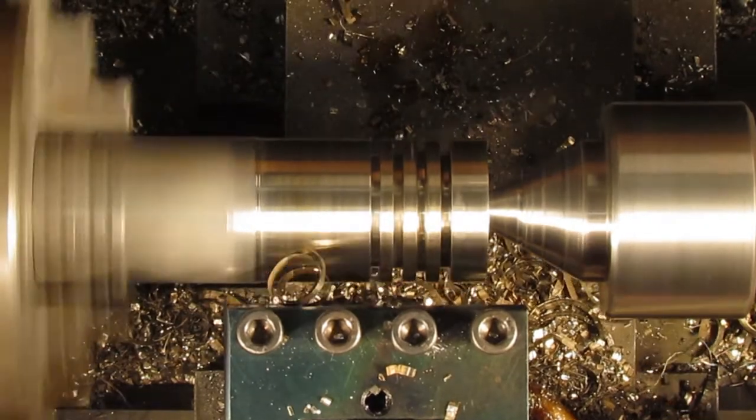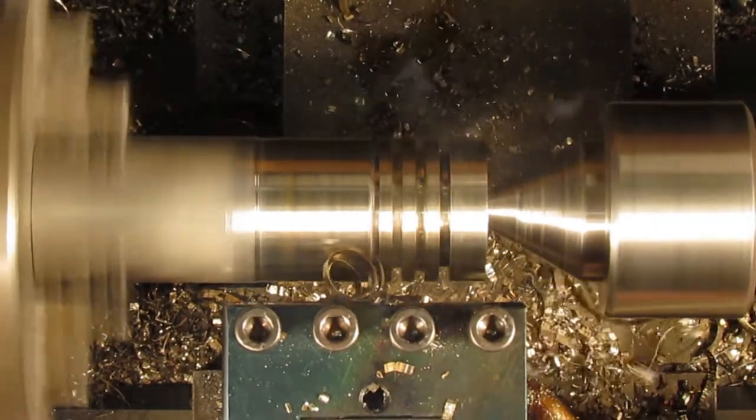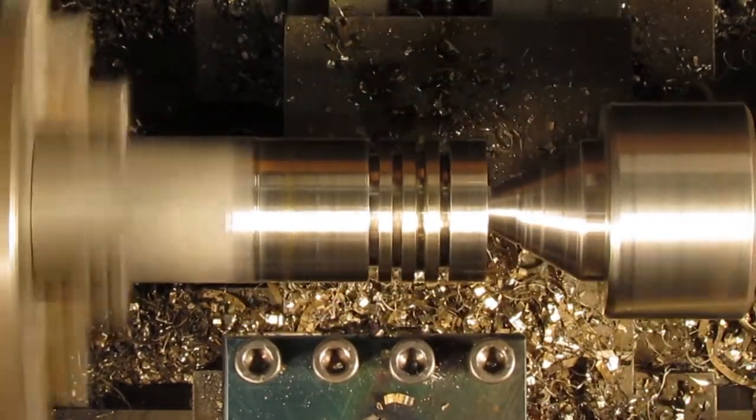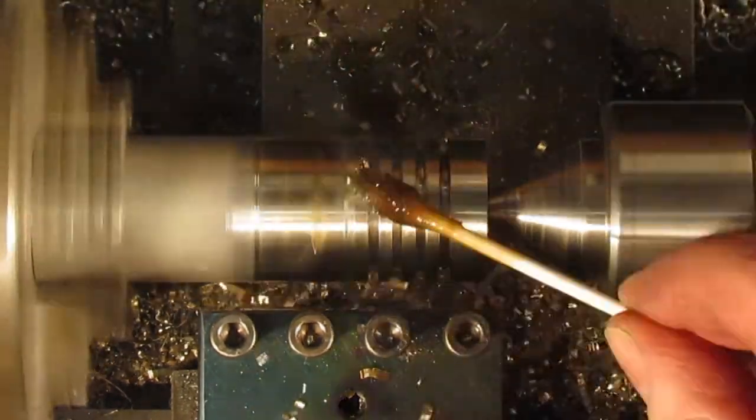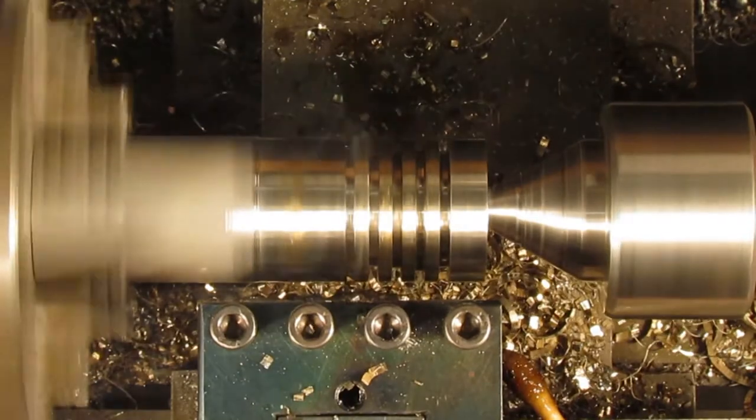Notice too, the position of the tool bit is changing locations on the holder as the machining progresses. Each time I have to pick up the face with the bit, move the thickness of the bit, and zero the caliper that measures the distance traveled for the carriage.